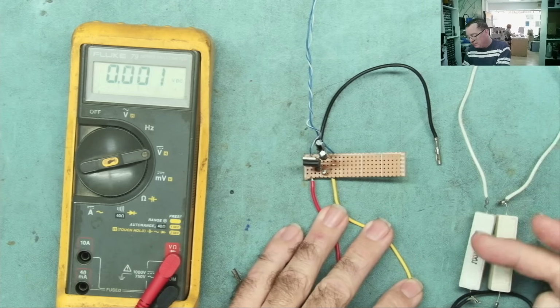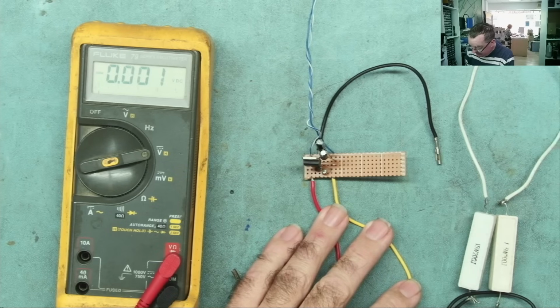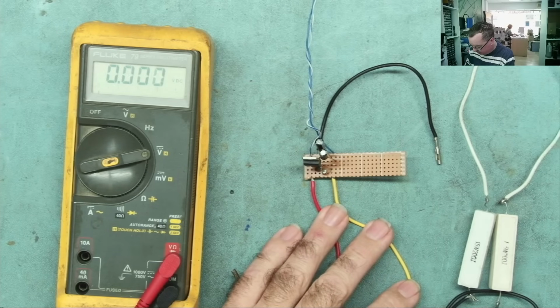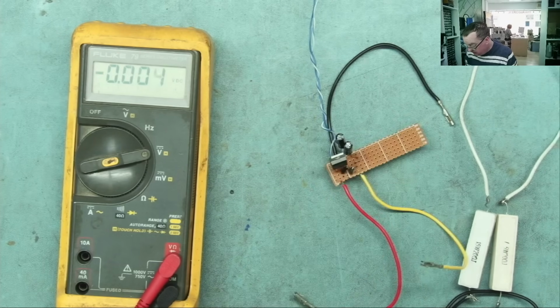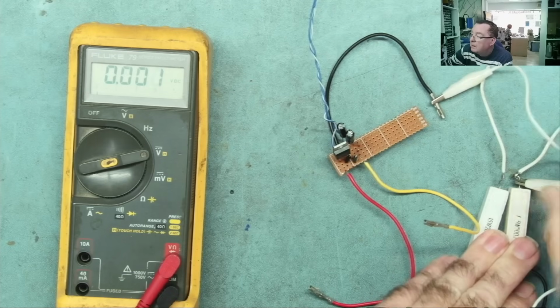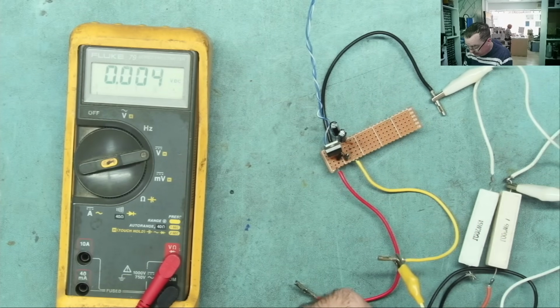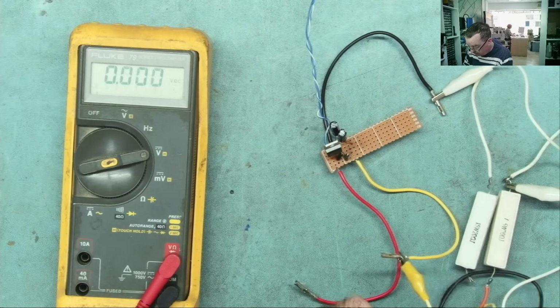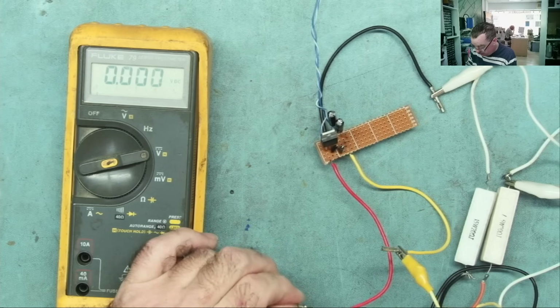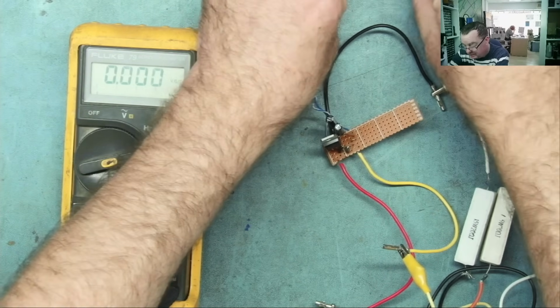20 ohms is about 0.5 of an amp, and 0.5 of an amp off the negative 10. So this will give about 1 amp of load, the same. We'll connect this to my little converter, so the junction of the 2 resistors to the ground. 1 resistor goes to the negative and the other one to the positive. And there we have our load attached. Now let's try it and see what we get.